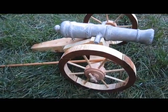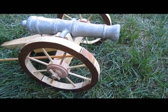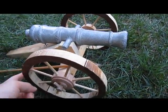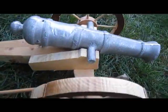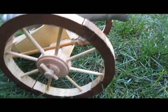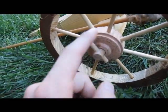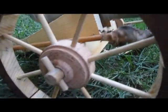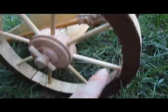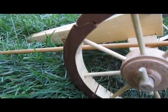The hardest part of building this carriage was building the wheels. The wheels were pretty intensive to build. I could have done a little bit more work on them in the sense of putting a steel band around the wheels, and I may do that in the future. But for now it works for the display piece that it is. The wheels are made with a central hub that I turned on the wood lathe. They have eight spokes each, and the spokes go into the fellows of the wheel. Each wheel has four of these sections, and they are cut to fit together.